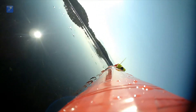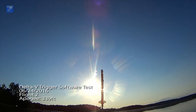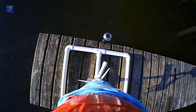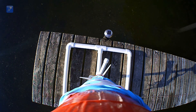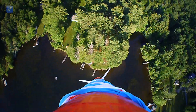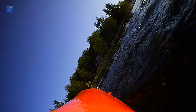Being excited about the successful flight, we reset, reloaded, and prepared for another flight before the sunset. As you can see from the onboard video, we had another malfunction. A review of the onboard video revealed the cause of the problem. The rocket apparently sprung an air leak just before launch. The escaping air apparently over-pressurized the barometric sensor in the parachute altimeter causing an error condition. Just prior to launch we could hear the air rushing and the altimeter beginning to emit an error code, which you can hear later in the flight. This failure happened a mere few seconds before launch so we didn't have time to notice it before firing the rocket.